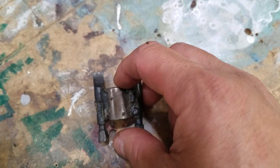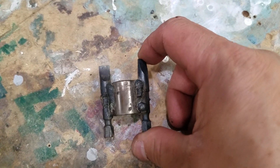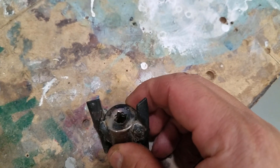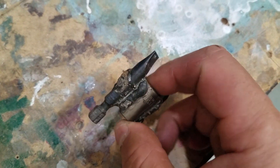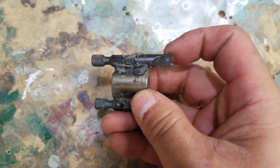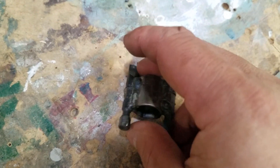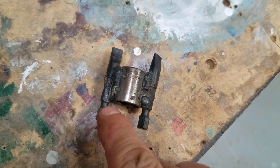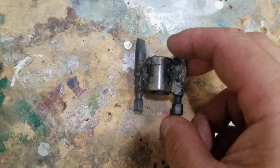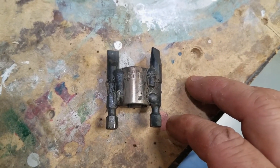We made this out of a 9/16th socket. I happen to have a quarter inch — just a random one I had around the shop. And then we had two — I think these are number two — flathead screw drill bits that have a little bit of extension here with a hex end. Just random. I hate flatheads so I had two of them and wanted to get rid of them. I didn't really need them but the important part is I needed the post here. And then I just welded up the seams right here on both sides. One side looks a little better than the other, but it is welded and it will hold.